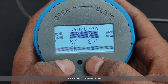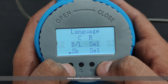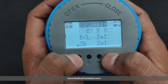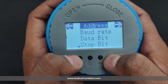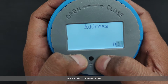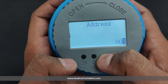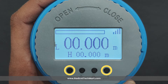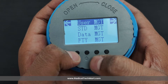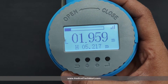When changing data, press Set plus Up key to move the cursor to the left side. Third is the Down key: in the menu this key is used as the down key, and when changing data it is used as the subtraction key. Press Set plus Down key to move the cursor to the right side. Fourth is the OK key: in the menu this key is used as the confirmation key. Press Set plus OK key to exit the settings screen after all data is changed.